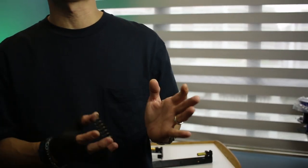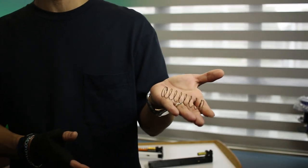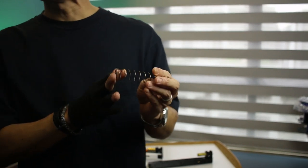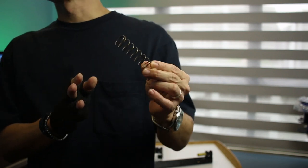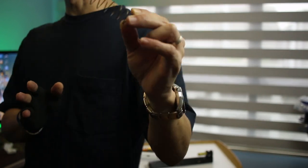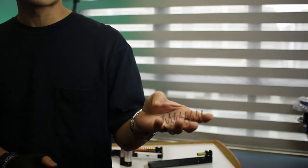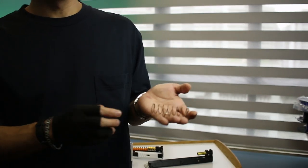Right, so let's get into the mod itself, let's go! So really you don't need any additional hardware for the mod except a single spring, and this is how it looks like. The OD, outer diameter is 20mm, and the ID is 18mm. So this will give you a 1mm thick spring. It's really light, I can compress it with one finger. Length-wise, I would go with 10cm.